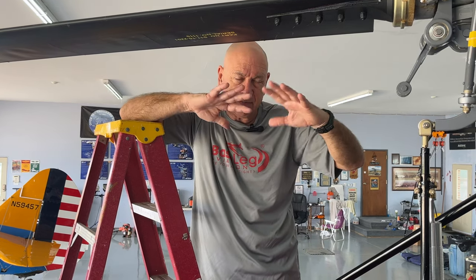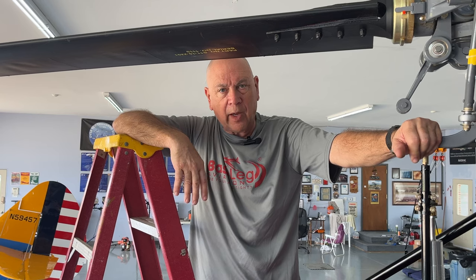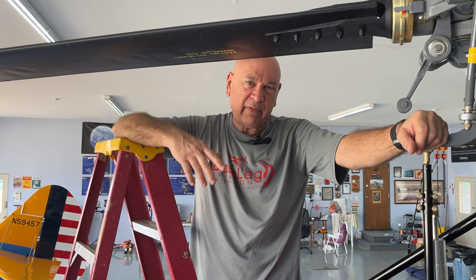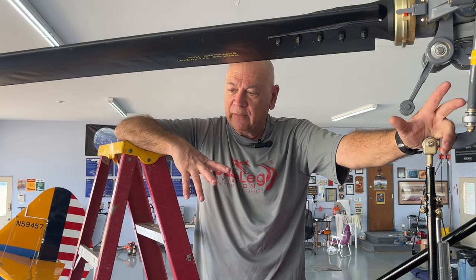So it's going to be a constant back and forth between trying to get it right for a hover and then balance that with what airspeed we're going to primarily fly at, because as you change the airspeed, the blade tracking is going to change as well. So anyway, helicopters are complicated, a lot of tweaking, no one-time rigging. It's kind of like having a heavy left wing on an airplane that you're constantly chasing. But we'll get there. I'm excited. The engine's running fine. No problems there. And we look forward to some more flights. Thanks for watching.